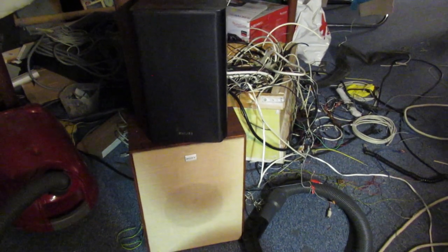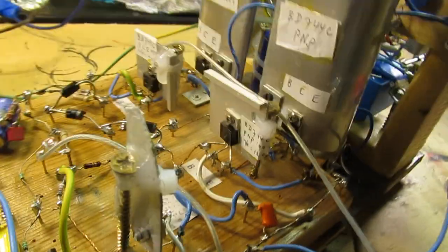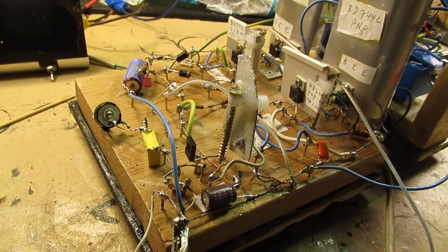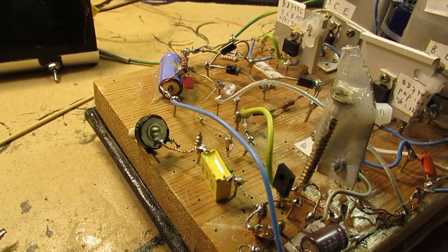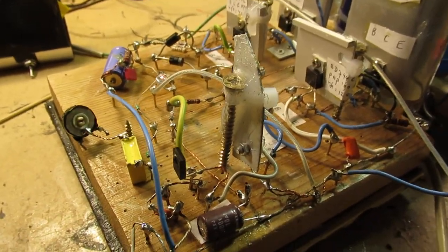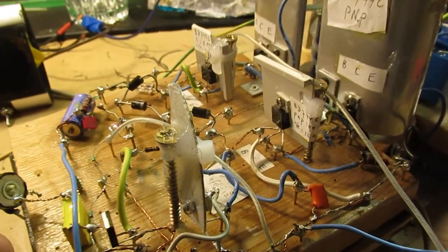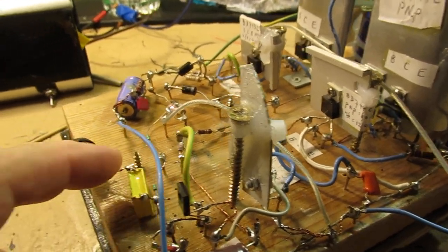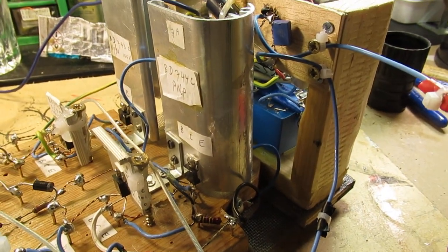That means that every wire here receives the hum signal that's present in a normal household. For 230 volts, it's 50 hertz. Perhaps there are, not perhaps, but surely there are other situations where this hum is 60 hertz. But it's very important. This shows that your amplifier is okay, by the way. And of course you connect your oscilloscope to the output where the loudspeaker is, etc.